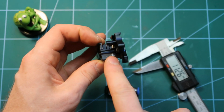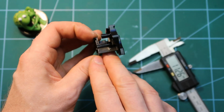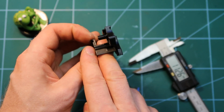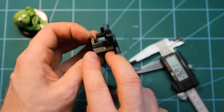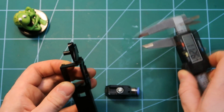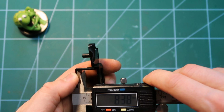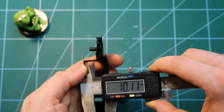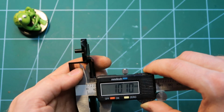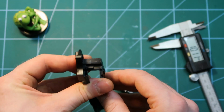You can see I have my middle of the magwell marked here. So I basically took half of the magwell width and added this wall from which I'm measuring with the caliper to reach this dimension. And of course it's good to always check if this makes any sense. So if I look here and I measure to the line more or less, it's 10.1, and if I measure on this side it should be also 10.1, which it is. So it seems that the line is really in the middle.